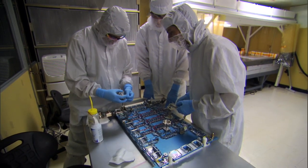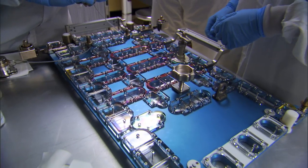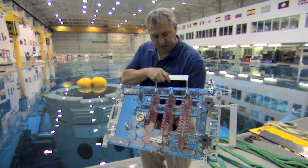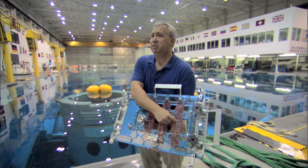In other words, as you take the screw out, it's loose — there's nothing holding it to the board. The engineers here at Goddard have been very creative in designing a cover plate that we can put on top, so that as we take the screws out, they'll be captured by this plexiglass cover. We designed what's called the fastener capture plate. It attaches onto the instrument, and it's got holes that the astronauts can access their tool into — small enough for the tool bit, but not large enough so the fastener can come out.